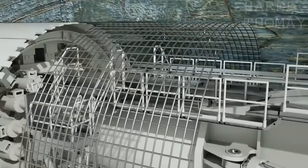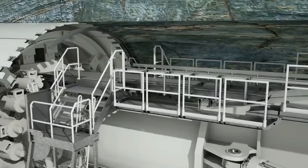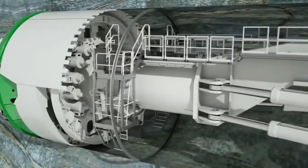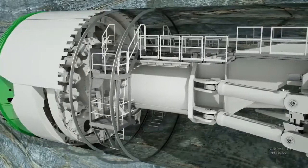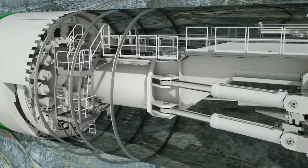The use of steel ring beams also helps to secure the tunnel. They are pre-installed directly under the roof shield. The complete ring is then moved to the installation position, braced against the rock, and mounted. Depending on the geology, rigid or flexible ring beams are used. The rock condition, with its geological and geotechnical characteristics, is decisive for the type and extent of rock support. In addition to the boring process, rock support is the key factor for the advance rate of the TBM.